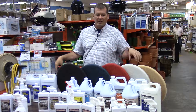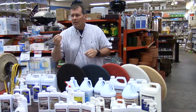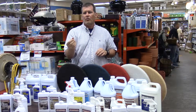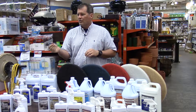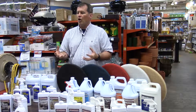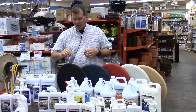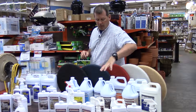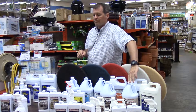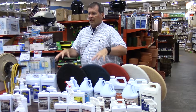You need to let it dry — fans on the floor, whatever. Once it's dry, here's a very high-tech thing you can do: take your hand, wipe it on the ground, and see if there's any white residue. If there's white residue on your hand, you haven't quite gotten all of the original material off the floor and you'd have to repeat that. It's very rare, but you want to ensure it's gone, because any impurities on the floor will affect how sealer or wax adheres.